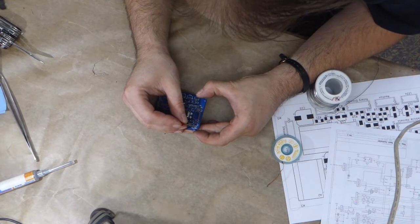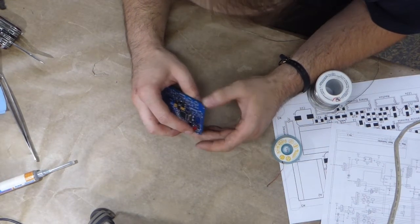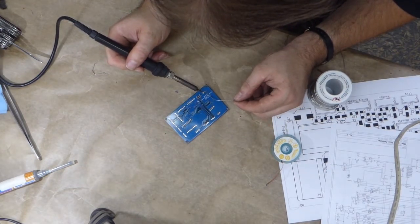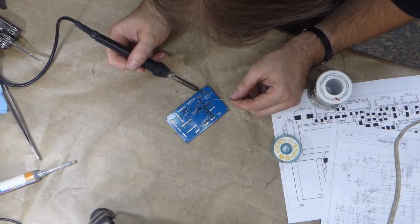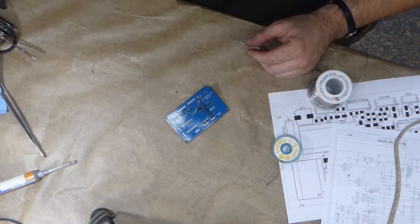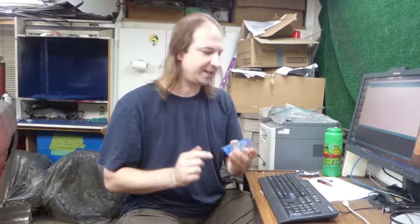And an LED to indicate power and for general blinking. And since I had a few extra pins, it makes sense to add an LED, use it as a general OK indicator, a heartbeat, whatever. With the minimal circuitry needed to run the processor on the board, time to test the processor. The traditional way to test a microcontroller is to simply blink the onboard LED.